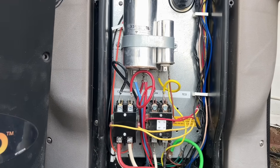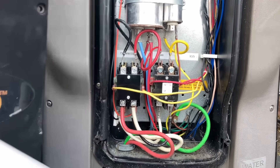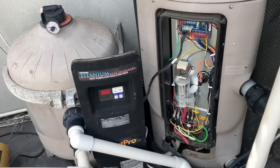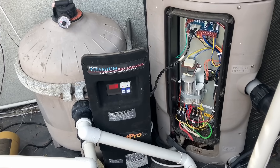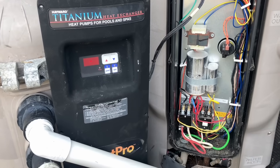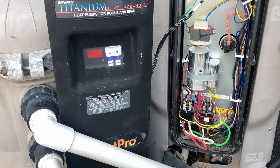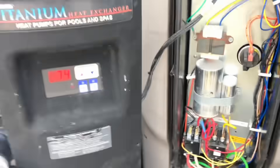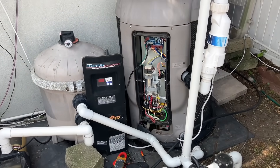Now if we apply power, it should work. I still think there's some kind of delay here, because that fan only comes on right away. H1, 2.2, 88 degrees. Now we wait and see — we have the dashes, which means it's some kind of delay status. We're going to wait for those dashes to disappear. All right, we're waiting for the time delay. 88 set, 74 actual.